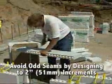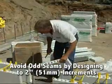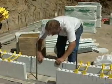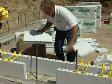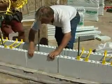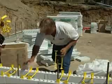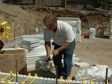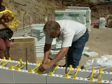Measure the remaining gap between panels, and cut panels about a quarter of an inch shorter than the measurement. Cutting these panels too tightly may increase the wall length and force the corners out of plumb. This seam will continue to the top of the wall. Since the seam probably is not on the 2-inch layout pattern, cut the cross braces out of a tie to form split ties that operate independently of one another. Place one tie on either side of the common seam.